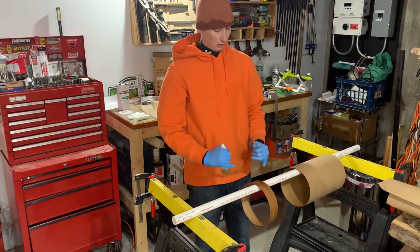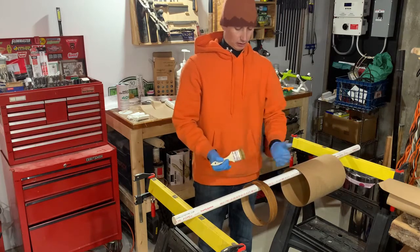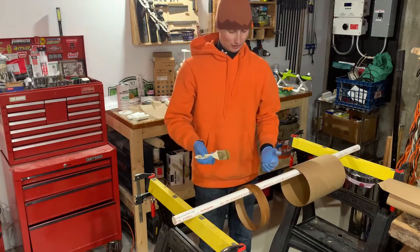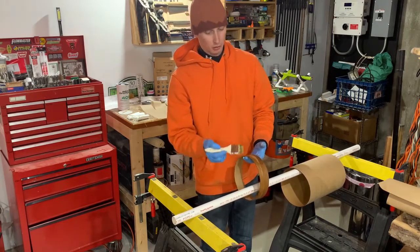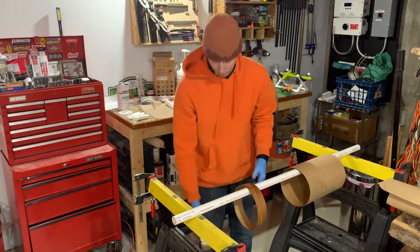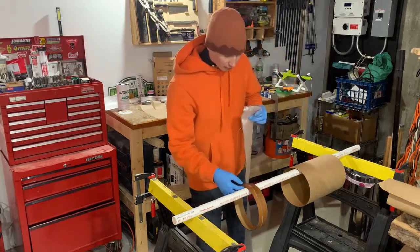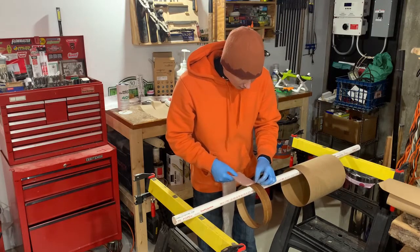I'm not concerned about epoxy getting on this PVC — I'm not worried about adhering to it, and I'm kind of hoping any little bit of epoxy that ends up on the inside helps just kind of stiffen it. Especially these edges — all my motor mount tubes I actually go around with CA to reinforce those. I'm hoping to just let this epoxy dribble everywhere naturally. So here's my first piece of glass, here's my line on there, and we're just going to start.